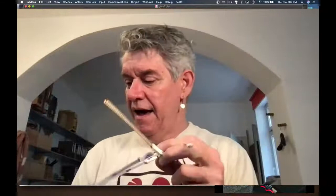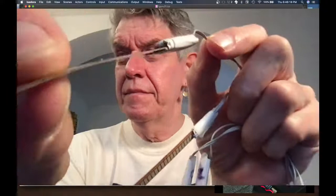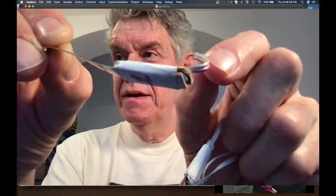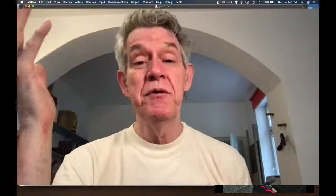And here are the sensors. I want to show you something that's really important. If you do anything like this in terms of your own inspiration, I don't know if you can see this, but if I get really close here, it's pretty hard to see, but can you see that there's two pieces of cardboard sticking out from under that tape? So the whole key, and this is where Dawn was, this was her thing, strain relief. Dawn was the queen of strain relief because these things broke left and right. Our dancers could be so physical. You saw how she was in the piece. It's a super physical piece. How do you prevent the thing from breaking during the show?